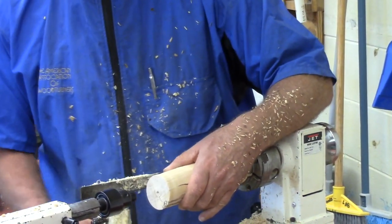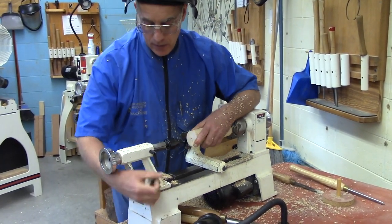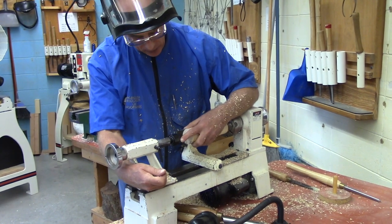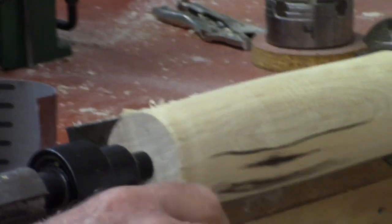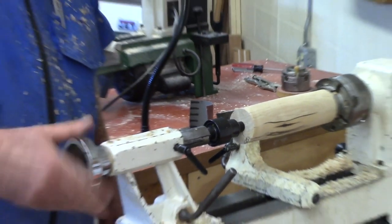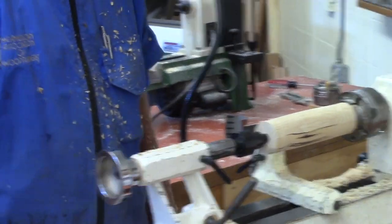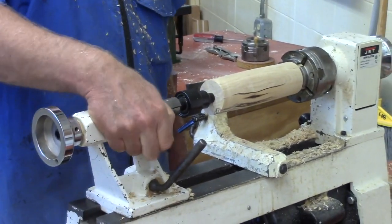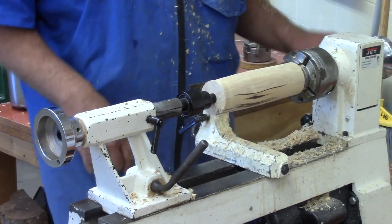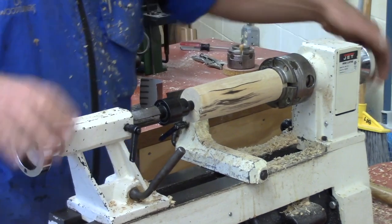Move the banjo over. Grab your dancing partner right here. Slide it forward, index finger, line it up perfectly with your indentation. Clamp, clamp, and now tighten the tailstock into the piece, like so. Lightly, three fingers, that's all you need for tightening the clamps. They don't have to be overtightened at all. Good. At this point, I'm going to spin it so everything finds its place.